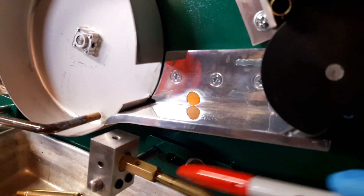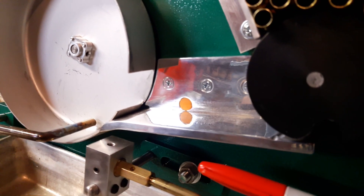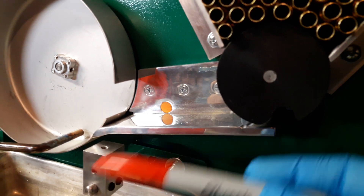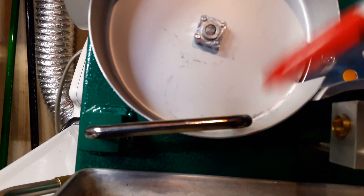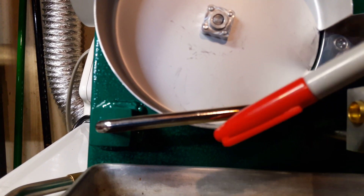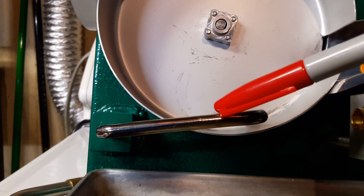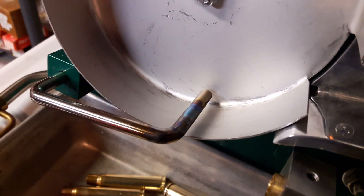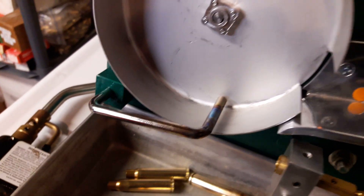The bar connects here and adjusts it forward and back. You can also tilt it up and down, and pivot it up and down or in and out, so you can fine-tune the flame position to the head of the case when annealing. For the support bar, you can use mild steel — I had some 304 stainless sitting around so I made it from that and polished it. The heat does get on it, so the stainless is just for rust prevention.